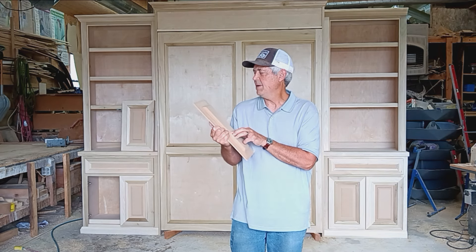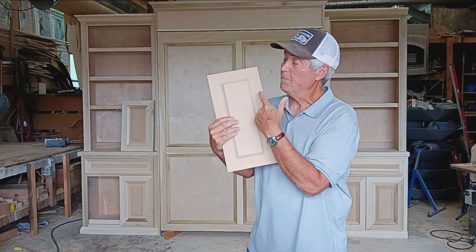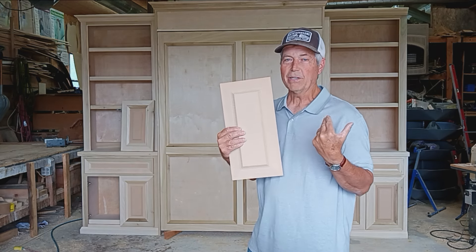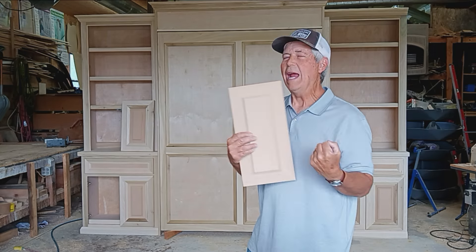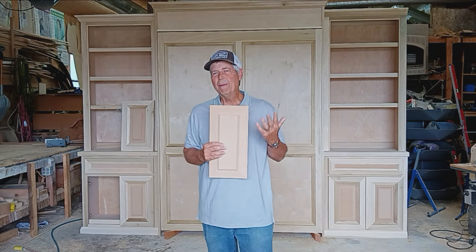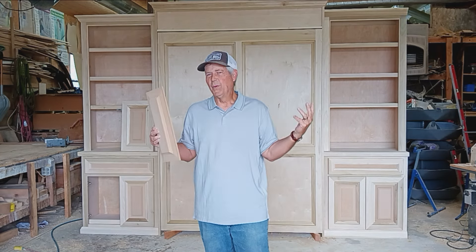Here's the piece of half-inch MDF. I came in about a quarter of an inch, and I just took another piece of half-inch MDF and used what I would call a classical bit — that is a router bit that has the cove cut right next to the bearing. That gave me a really good-looking raised panel.